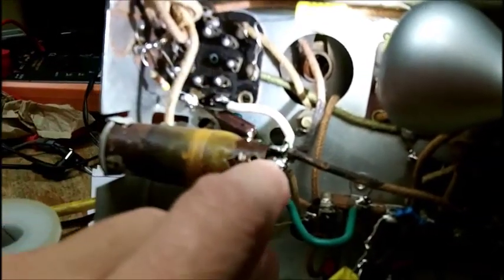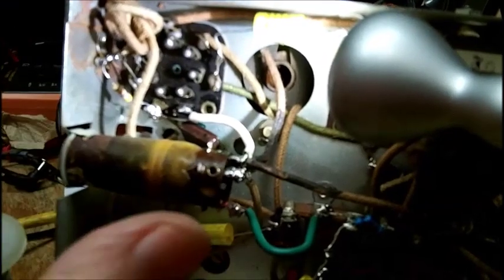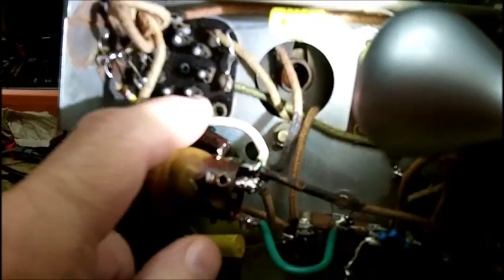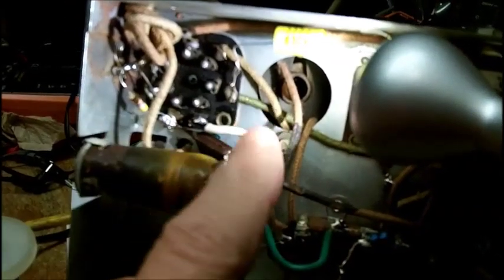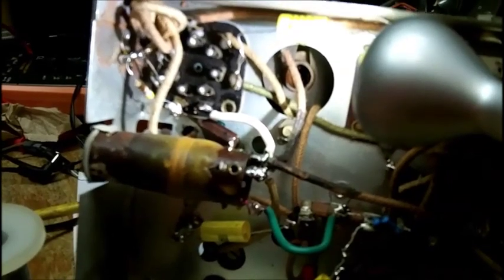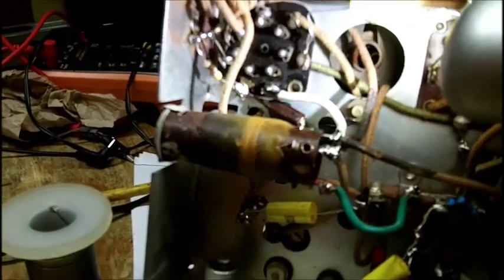It really will. Because I put so much heat on this, kept pouring solder in, pumping solder in. I held it down with a needle nose. I tried everything, and it kept coming off. I tinned everything. I tinned the wires. I scraped them with a razor blade because they wouldn't take the solder, the old wire. Finally got them tinned good. Still kept popping off. Unbelievable. I'll never do another one of these again. No way. It's about the hardest job I've ever done on the radio, and you can see why I will not work on any IF cans or anything else.